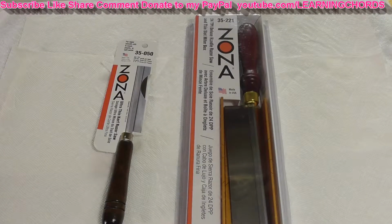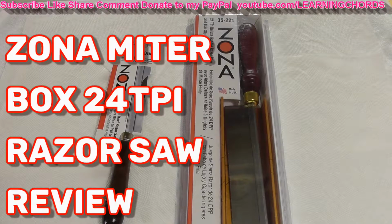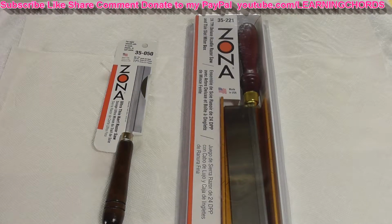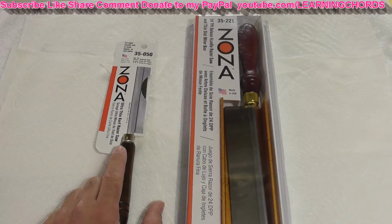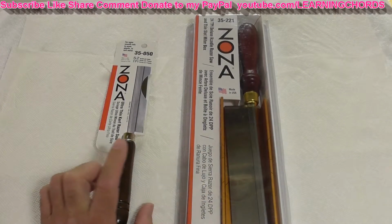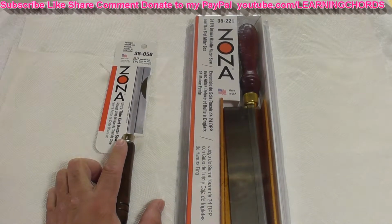This is going to be a video product review of the ZONA Deluxe Razor Saw with miter box. Deluxe fine kerf saw with aluminum thin slot miter, made in the USA. The saw has 24 teeth per inch. I'm going to be comparing this to the other saw that does not come with the miter box, and this has got 52 teeth per inch.